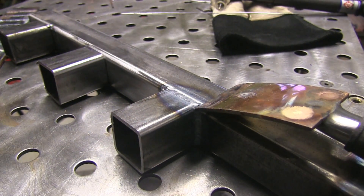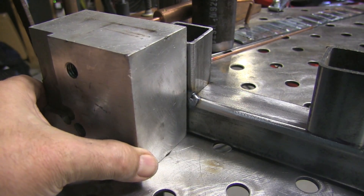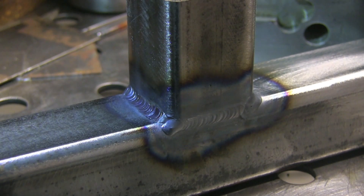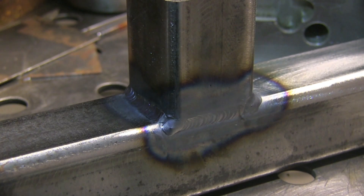Here I use the copper spoon again to come out of the puddle. You could use a copper spoon or pieces of aluminum — a block of aluminum. I'm going to show coming out of the puddle on that block of aluminum on this type of joint. When I get to the very end, it's just a matter of pulling the arc over onto the copper spoon or the block of aluminum. I'm going to add a little dab of rod and come over to the block of aluminum, then snap out. I would definitely prefer a foot pedal on something like this, but just trying to show you what you can do with a simple scratch start TIG. It's pretty nuts that today you can do scratch start TIG with a welder that weighs like 20 pounds.